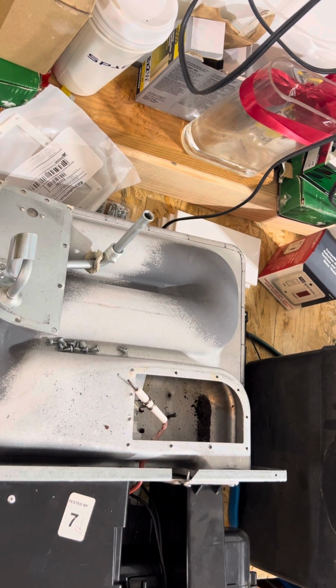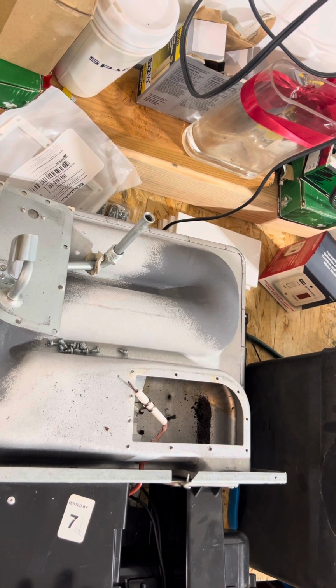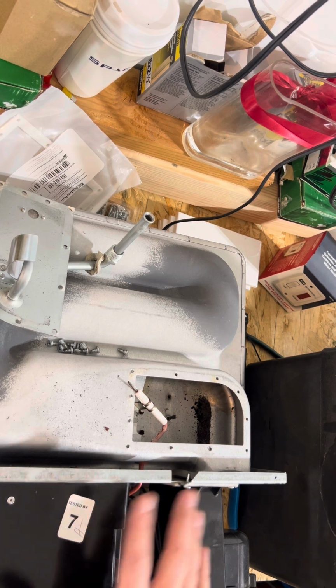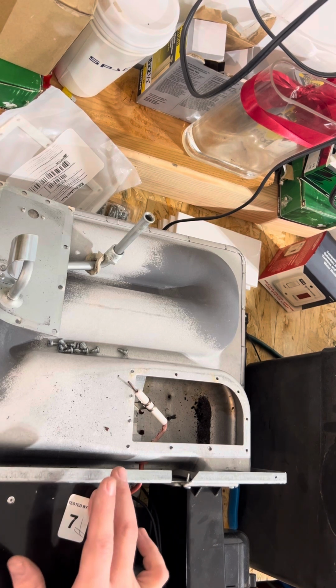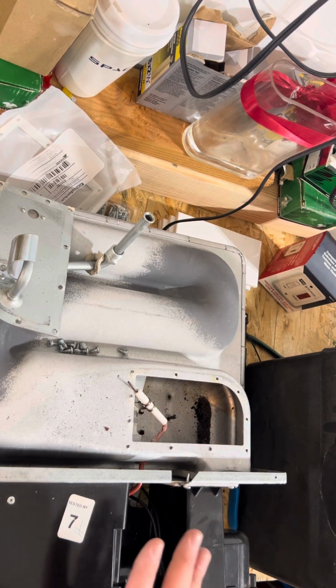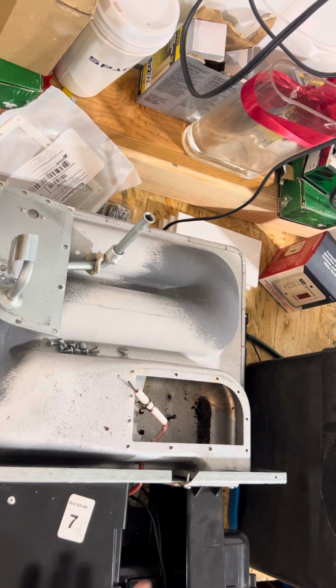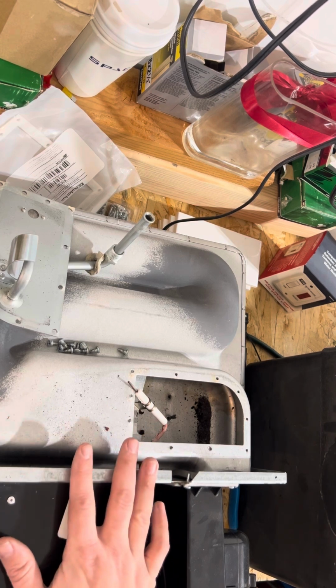And Suburban has gone out of their way to make them affordable for people. So if we do have to replace your furnace entirely, we will tell you why, and whether it's a matter of safety or just because it's being too old, or maybe the exhaust manifold has an issue. There's usually a pretty big reason. If we were to need to replace the blower wheel, the motor, the burner, the igniter, the sail switch, now it's time to just replace the actual furnace because it's more cost effective, and we don't try to make our money on selling the part. We make our money on the labor of removing and installing the part.